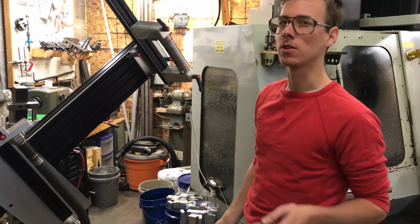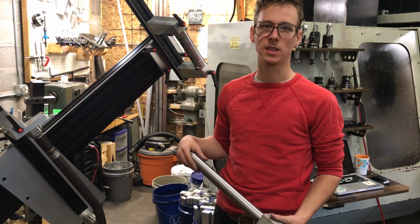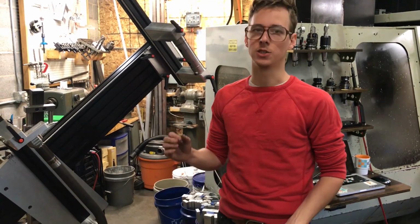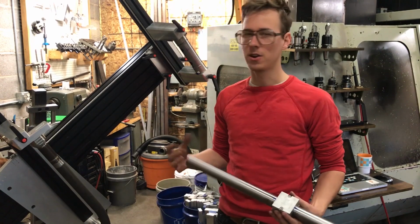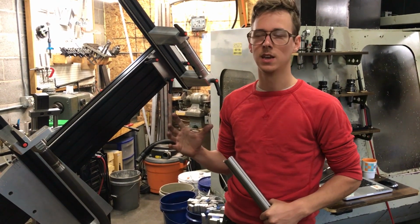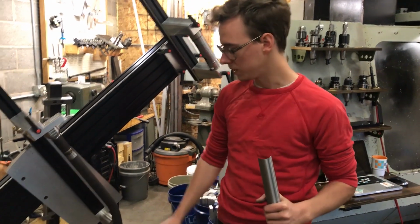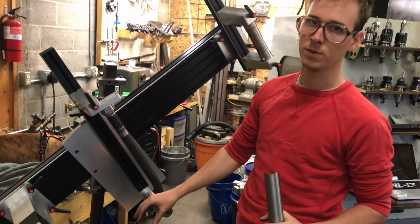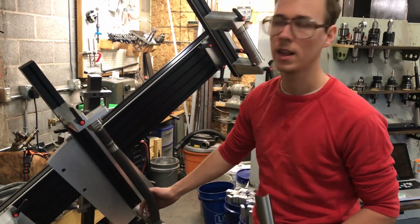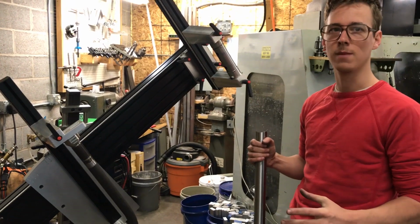Mountain bikes are particularly hard to build, I think. Out of all the different kinds of bikes, you've got some cargo bikes and things that are complicated, certainly. But with road bikes and track bikes and cyclocross bikes and stuff, I feel like a lot of other bikes tend to be easier, and mountain bikes get more and more complicated because you have tighter clearances, like between the chainring and the tire. It's kind of a tight spot on a lot of bikes. If you want to bend the seat tube, that gets complicated. You start worrying about the fork crown clearance. There's just a lot more going on with a mountain bike.